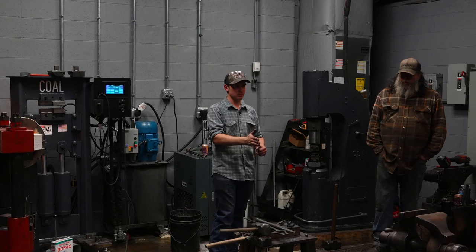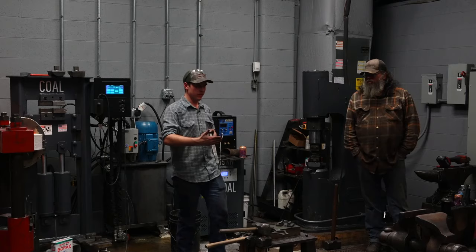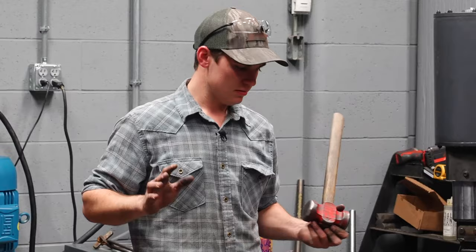Yes. What does center high and high mean? So center, high and high: center is the center of the hammer. Okay, I said three hills, three valleys. Who's seen a rounding hammer that someone made, or I made, that had three fuller lines on the cheeks? Okay. Personally, I consider that an unfinished hammer. It's an opinion. But that's what I mean.